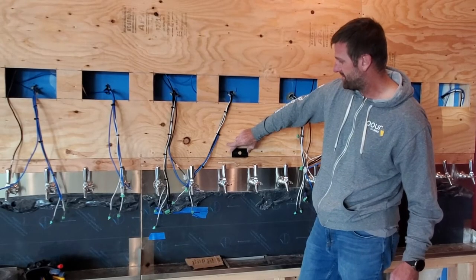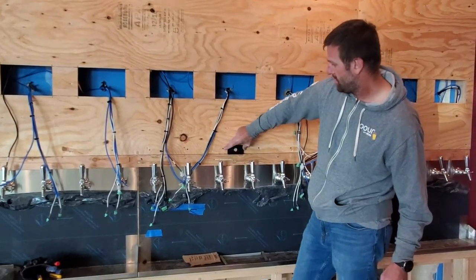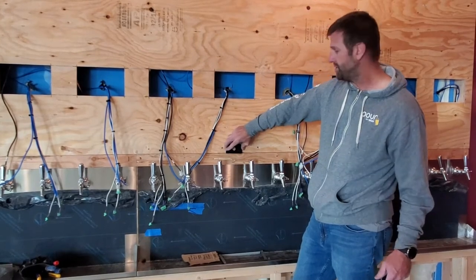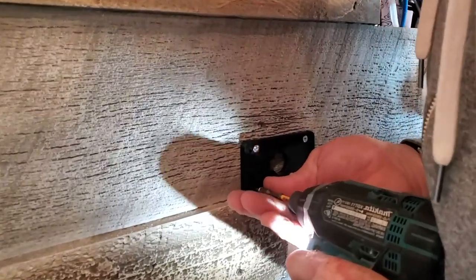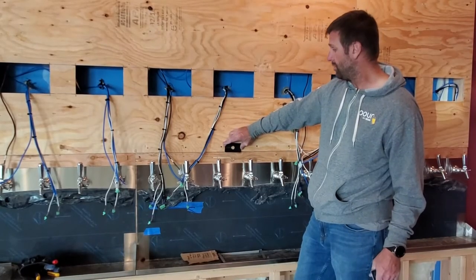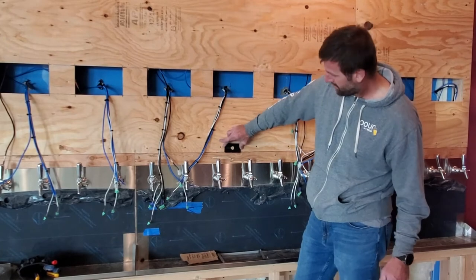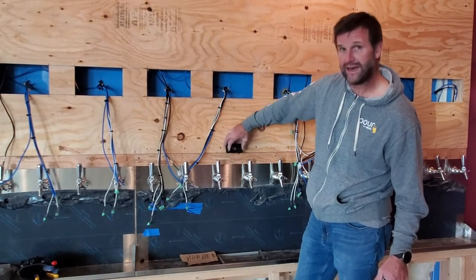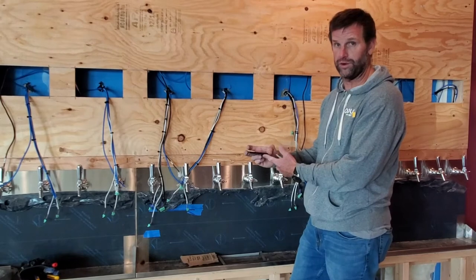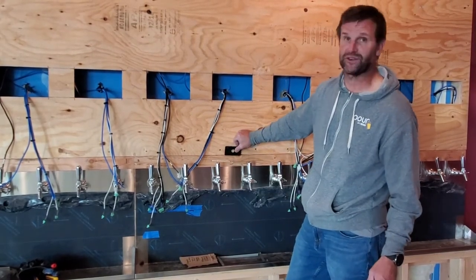Another thing that we have to consider is the mounting surface for the RFID reader plates. We won't have any issues with wood or mounting on tile. However, if you plan to use stainless steel, aluminum, or brass as a backing material for the RFID reader plate, you will have to shim out the readers off the wall with wood, as it causes the RFID signal to deteriorate.